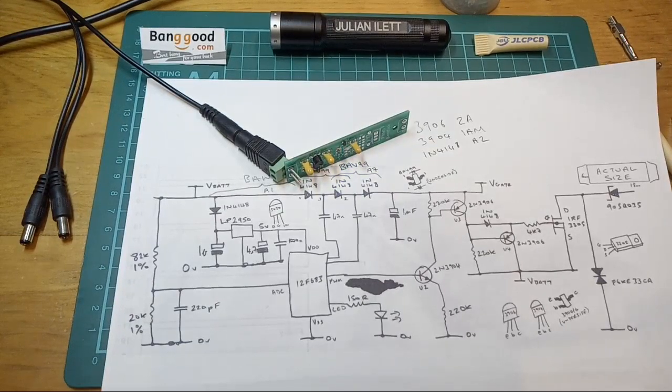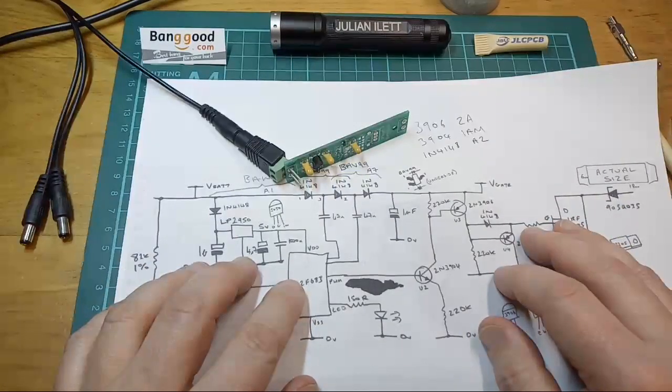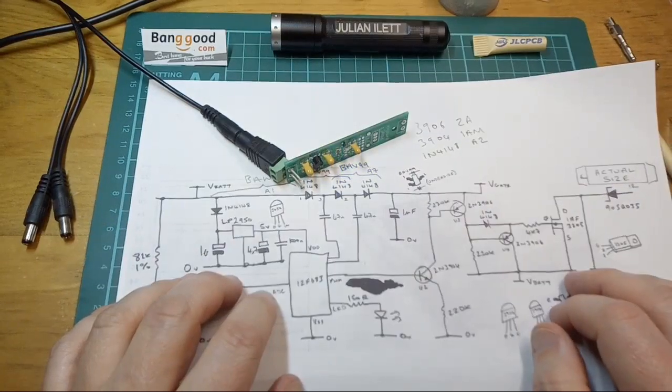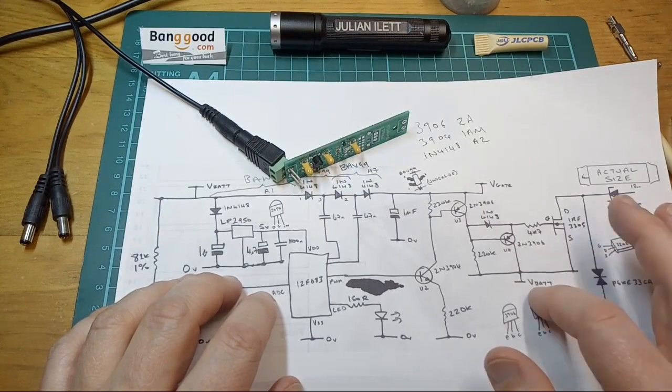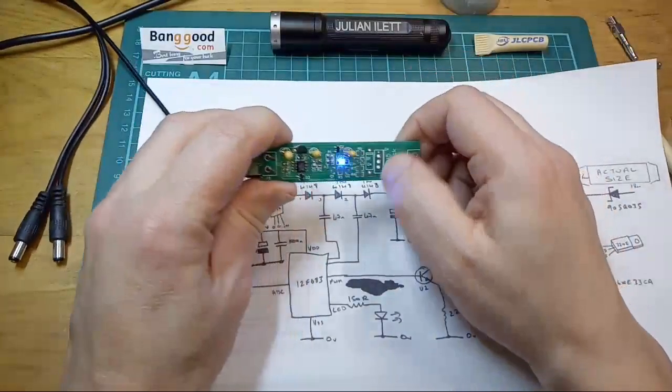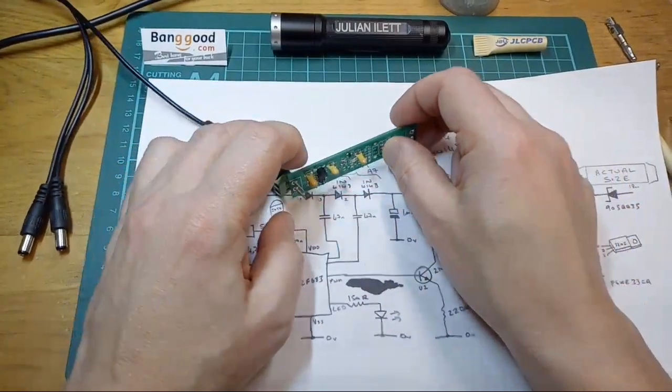Are your solar panels mains connected? They were. I've got a grid tie inverter. I probably shouldn't admit to that because they're not legal for use unless there's some sort of accreditation you have to have. But I haven't had that grid tie inverter connected for probably 5 years now, because MOSFET Q10, and I remember it very clearly, keeps blowing because it's a rubbish design. And it's hard work taking it apart and replacing MOSFET Q10. And the through-hole plated board has had so many new MOSFET Q10s fitted that it's all starting to fall apart.